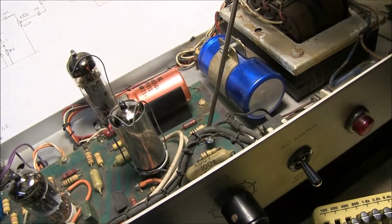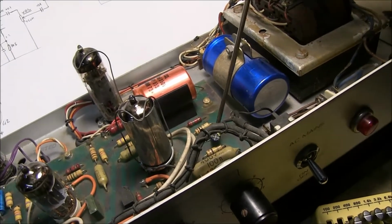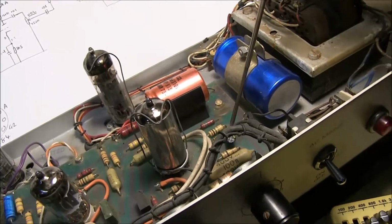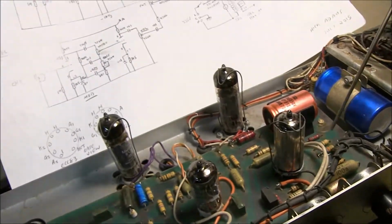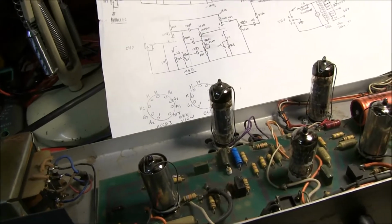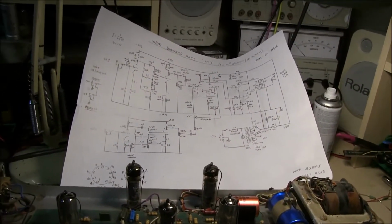Capacitor there, anything above 10 microfarads, even higher, up to 100 microfarads, no problem. Voltage wise, anything above 16 volts, no problem. If you want to do the other one, you can do it as the 1K5 over here. So let's just check out the sounds.